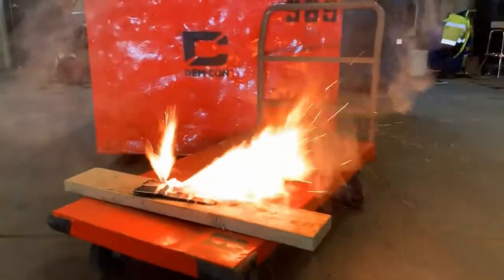So when I installed this guy inside of the Red Rocket, I got lots of comments about how the battery's going to explode, the battery's going to catch fire. Guys, that's simply just not the case. What you're thinking of is lithium ion batteries like the ones inside of our cell phones and tablets. This is a lithium iron phosphate battery, and they don't catch fire and explode in the same way. They're a lot safer, and that's why the FAA has approved them from EarthX to be put inside of planes.